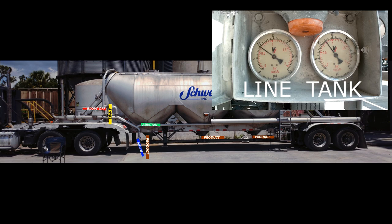This first pod is just about empty. I can hear the aerators starting to vibrate a little, and also hear the tank air pressure start to rush through product air line. So I close the first pod for a second, and then open back up. The tank gauge pressure started to drop quickly. Close back up first pod product valve. That pod is empty and I will come back for any leftover dust in final cleaning process. And open second pod.